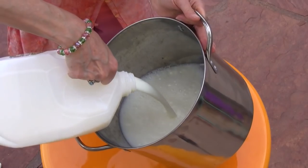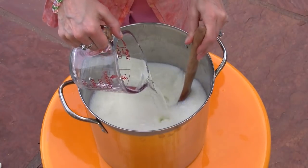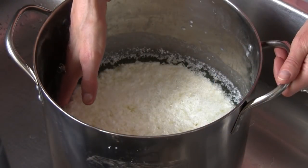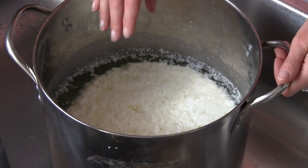I'm going to show you how to make what is called quark, the foundation for traditional milk paint based recipes. Quark is created when vinegar is added to fresh milk. This isolates the casein protein, causing it to curdle and lump together and separate from the liquid whey in the milk. There are recipes for creating milk paint that use only milk and lime, omitting the vinegar curdling step, but using quark as the base creates a stronger milk protein and makes the paint less susceptible to mold.